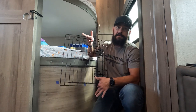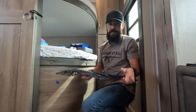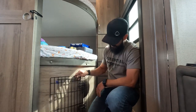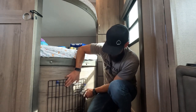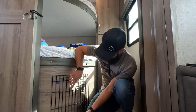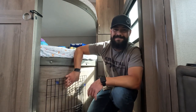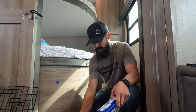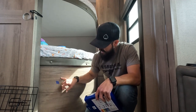This piece is a little bit curved, so what I did is grab it, put my knee on it, bent it slightly so it matches the wall. Once I put some bolts in it'll probably take that shape even better. I've got to figure out where the bottom post is behind the wall and start there. I'm using a Dremel — the reason is on my last one I used a jigsaw and it kind of tore things up, so I'm going in very lightly to make clean cuts.